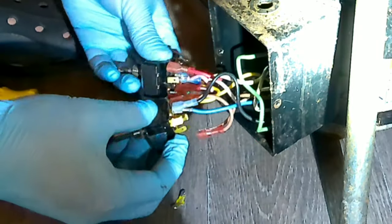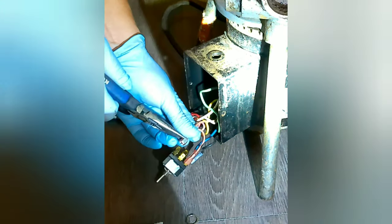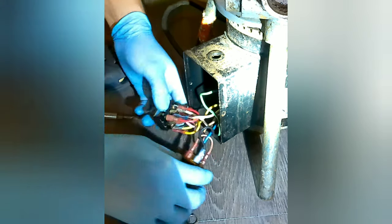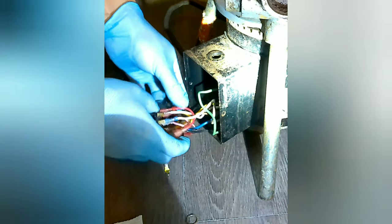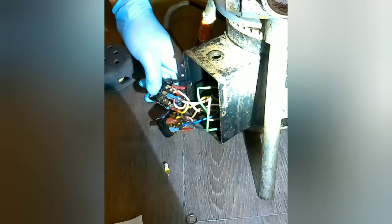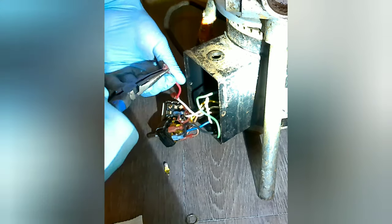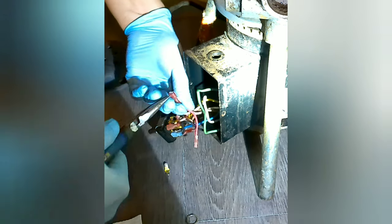Not only that, but you won't remember how to wire the new switch in case you get a new one after you've already burned the first one. So it's pretty much the same process — take out one connection and transfer it to the new one, one by one, making sure each one goes to the right connection on the new switch. I'm pressing on the tab so it can stay tight on the new switch; all of them needed to be pressed like that.